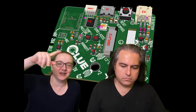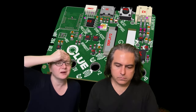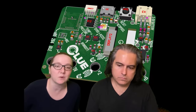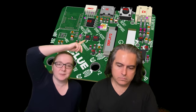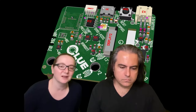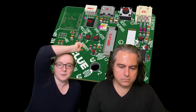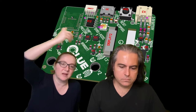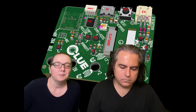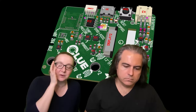I could get the nRF52840, then I couldn't get the microphone. I could get the magnetometer, but then the 6DoF got discontinued — it really did get discontinued, so that got swapped out. I couldn't get the magnetometer for a while, but it came back into stock at a reasonable price. Eventually I got it sorted. This revision changes the LSM6DS33 to just an LSM6DS3, which is basically almost the same chip in a slightly different package.